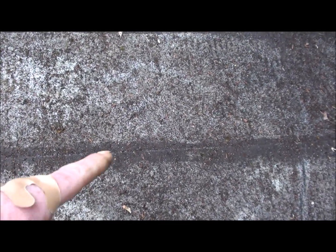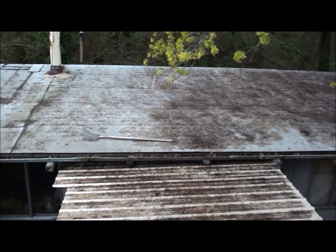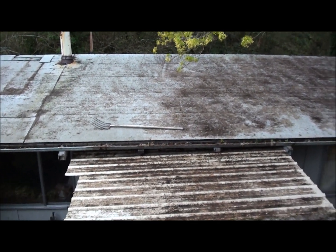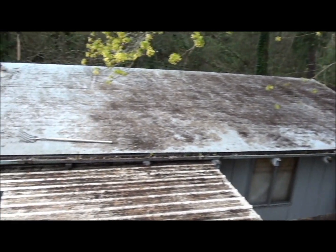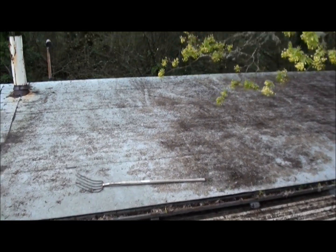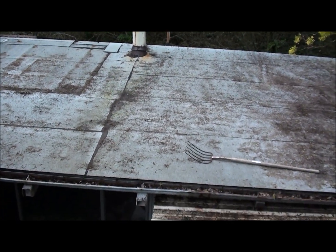Whoever did this one here, they got nails in all the seams down here, and the tar shrinks back, so there's little bits of nail heads sticking up. Anyway, when I do mine like I did over there, I nail the top row of each piece of paper, but underneath I overlap a good 6 inches, and that entire 6 inches is covered in tar, so the bottom end sticks down. No nails in the bottom of any of that paper over there. There are no exposed nails in any of that stuff. I just nail the top and layer over and glue it down.